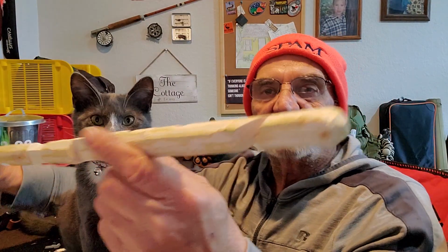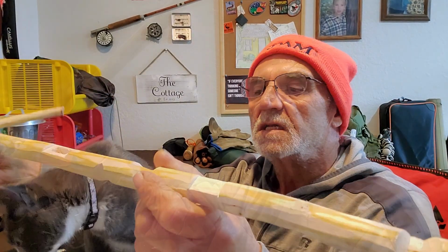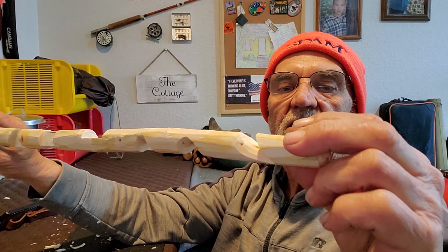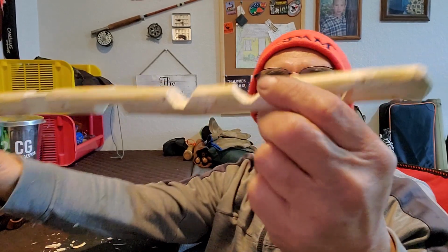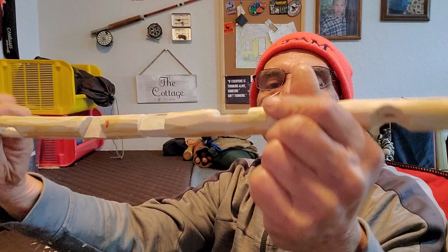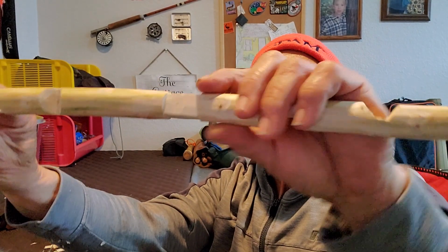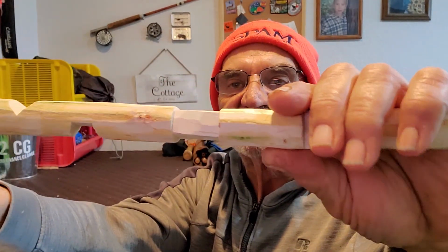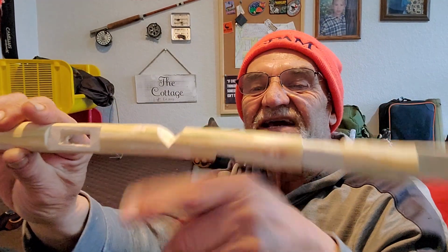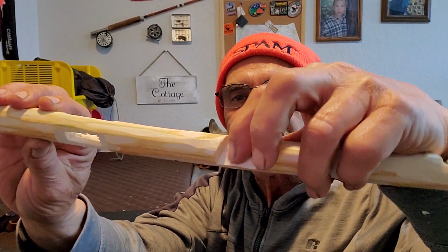There you can see here, I've added quite a few notches to it, and I'll go through them quickly with you. As you can see, I've been working on it. Here, of course, you saw me do the pot hanger, the rounded notch, the saddle, and I explained the difference between them. Here you just have a basic square notch, just cut out, and here you have a square trim. Here you have a very plain V-notch, and here is a dovetail notch you can see here.